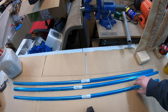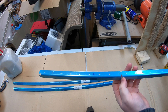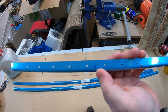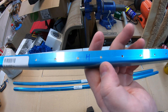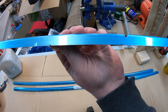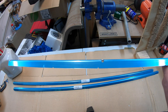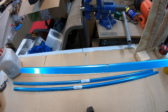Here we've got several sections of stiffeners that we're going to be cutting. They come as long stretches and have a little notch already cut out — that's where we'll be cutting to separate the different pieces. I've already labeled the lengths: H, F, H, and the last F piece. You'll also notice these little notches, and what those are for is drawing a line from notch to notch to cut the angle. Once you cut that angle, it gives you the clearance needed as the rudder skin is bent closer together.